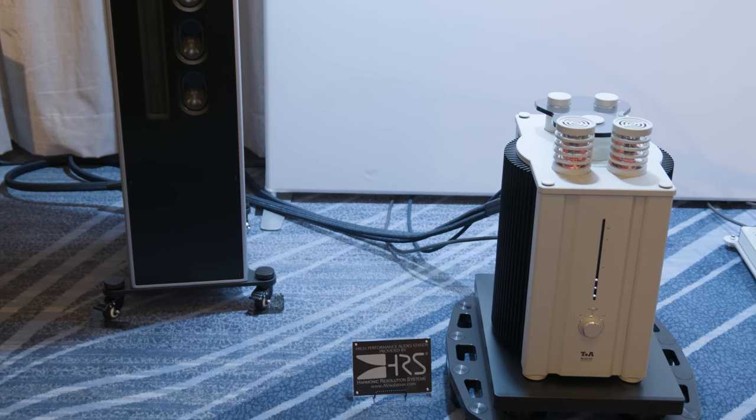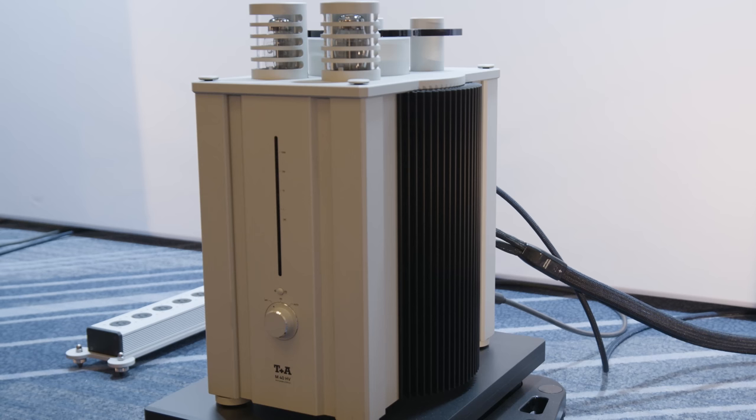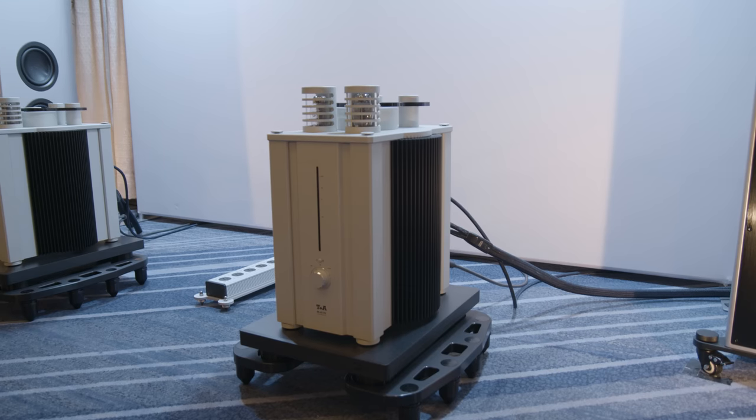With so many mid-ranges, do you lower the crossover point? Yeah. The crossover point is now 180 hertz. That's my favorite for designing loudspeakers, because I think it is very important that the human voice is covered by one speaker only. So where's the crossover to the tweeter? 1800 hertz. It works perfectly. The advantage is simply that we have no phase shifts in the voice area.